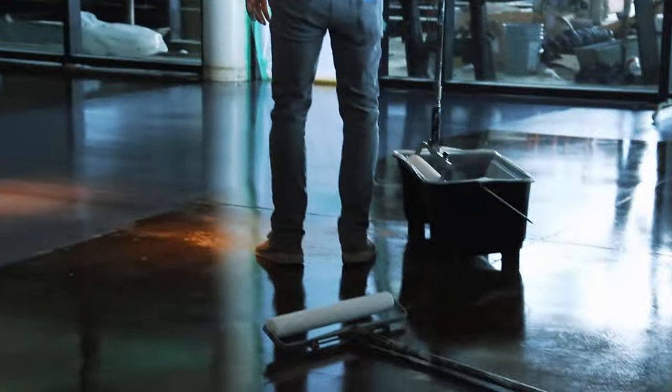After they were open for a couple weeks, we got a call back — hey, can you come back and redo the patio? It's slippery. We said, we did it right the first time. They said, I know, we just want you to redo it and put grit in it. The thing is, we had warned them: it was a broom finish patio and they had us grind the broom finish off. We told them the broom finish is there so it's not slippery — especially when people may have had a couple beers. Did you really think it was a good idea to smooth out the concrete outside? So we went back and did another coat of the same stuff with a lot of grit in it to give it a sandpaper finish. Who knew a slippery floor at a bar would be a bad idea?